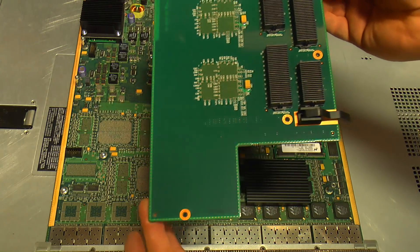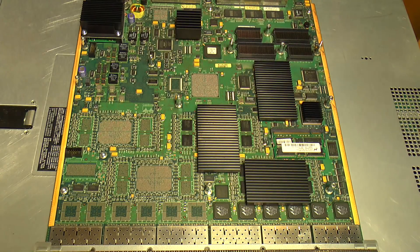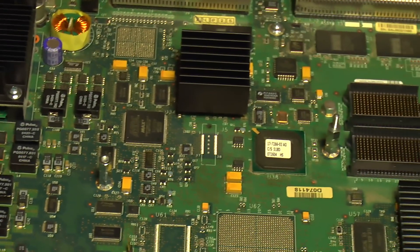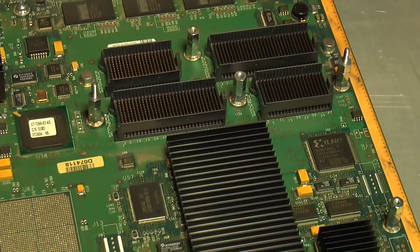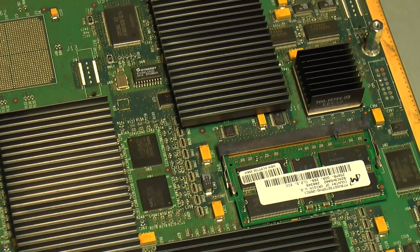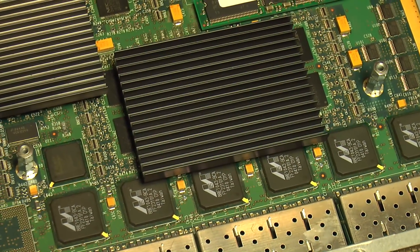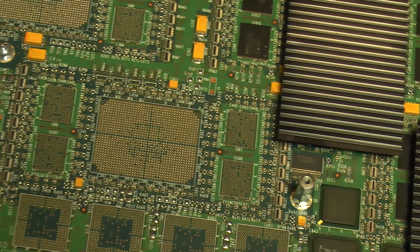There's absolutely nothing to see on the CFC because of the heatsink, only to be faced with even more heatsinks. These cards have a metal plate bolted on the back so we can't see the backside, although looking in from the side there's not a lot behind there anyway. On the top, there are only a few chips uncovered — some Cisco, some Xilinx, some RAM, a 1.5GB DIMM — and along the front, possibly the only chips of interest: half a dozen Marvell quad-port fibre transceiver chips. And as this is only a 24-port card, the other half is pretty much empty.